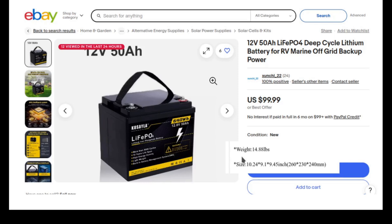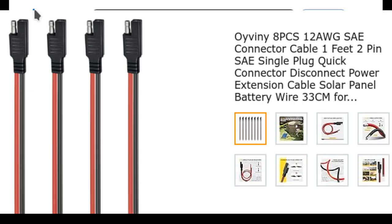Or you could buy the premium brand at five times the cost. The cheaper batteries weigh 14 to 15 pounds. They make 36-volt lithium batteries, but you can use three 12-volt batteries in series with three small chargers. You can have them pre-rigged — zip-tied together — and just plug them in. I use SAE connectors as pigtails to plug them in.